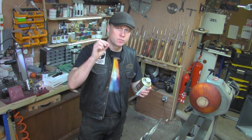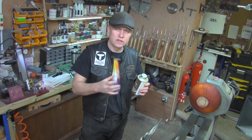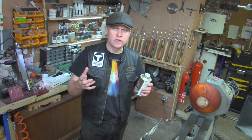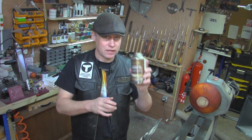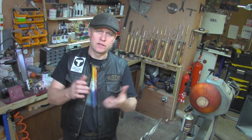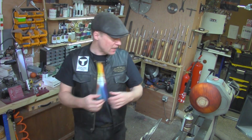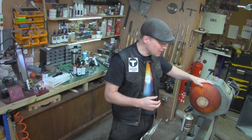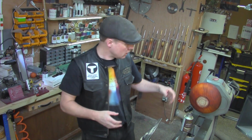Now John's question was specifically about my use of oil as part of my finishing process with sealer over the top. And the best way I can explain that is I use a drying oil, particularly Hampshire Sheen's food safe Danish oil, as part of the finishing process as an embellishment rather than a finish on its own. It's a drying oil, so it polymerises and it dries hard. And as you'll see in a second, it makes the grain pop, as all oils do.